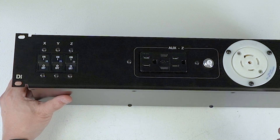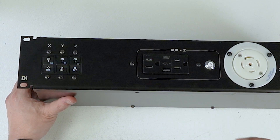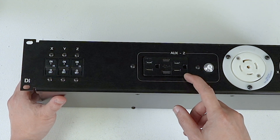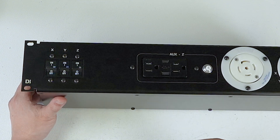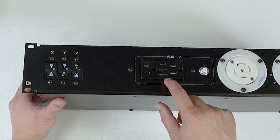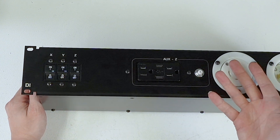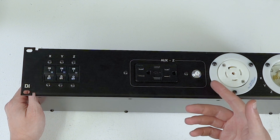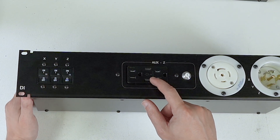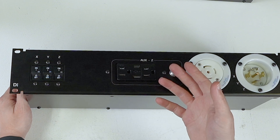In 2024 we're in that weird transition where both USB-A and USB-C exist in the world. I've been speccing these for everything recently — I've gotten into trouble on systems where I only had USB-A or only USB-C. This combo outlet helps. They do make a dual USB-A version and a dual USB-C version. The double USB-A is about $20, the dual USB-C is about $55, whereas this one with an A and a C is about $35 — so it's just more economical.